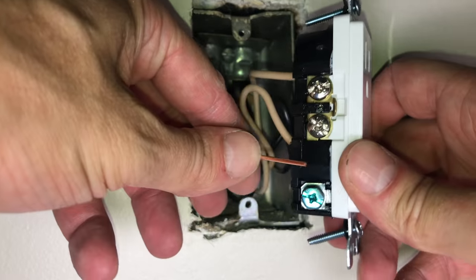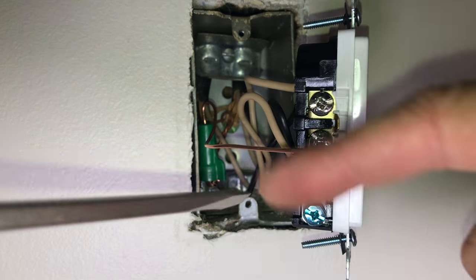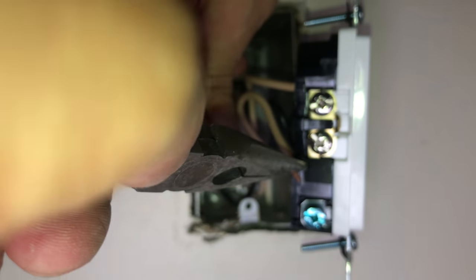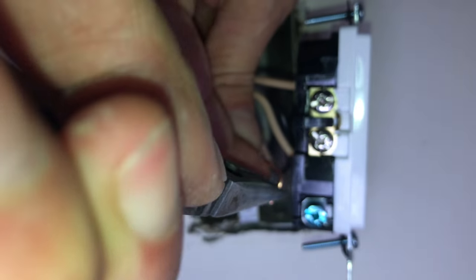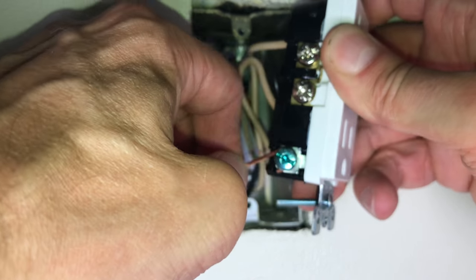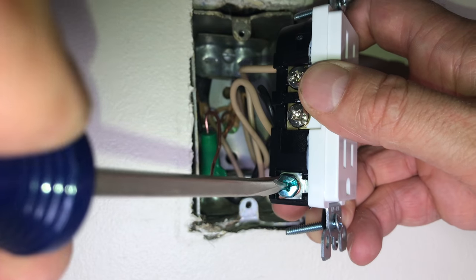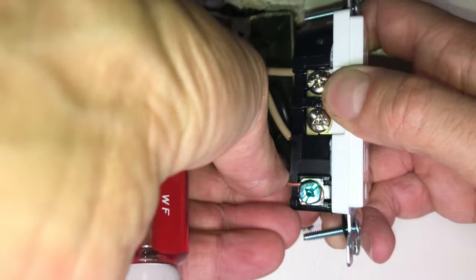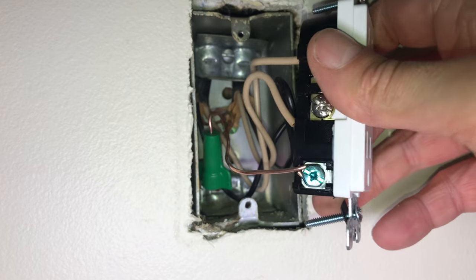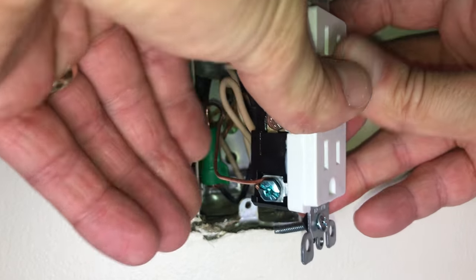There are a few details to consider. When wrapping this copper wire — which is 14-gauge — around the screw, we have to consider the direction we turn the screw. Since we turn the screw clockwise, we want to wrap the ground wire clockwise around the screw as well. I'm taking my needle-nose pliers and twisting the end clockwise into a little U-bend, then fiddling it around the grounding nut. When I tighten the screw, you can see the wire tightens itself around the screw. The wire goes all the way around as you tighten the nut — this is the correct way to do it. Always go clockwise around the screws.